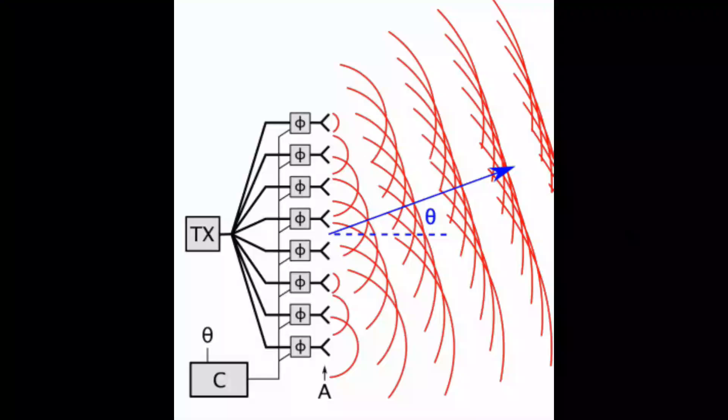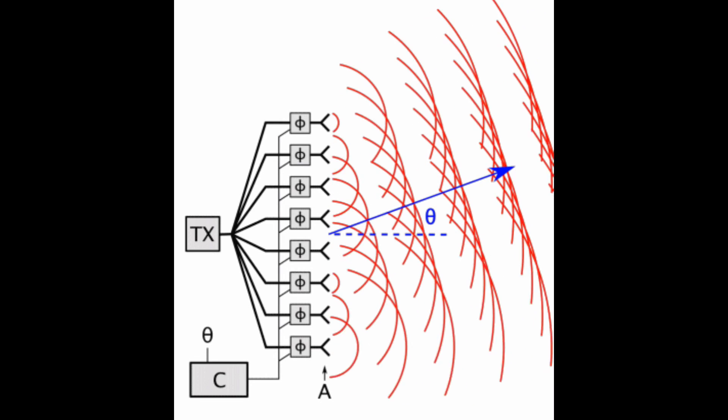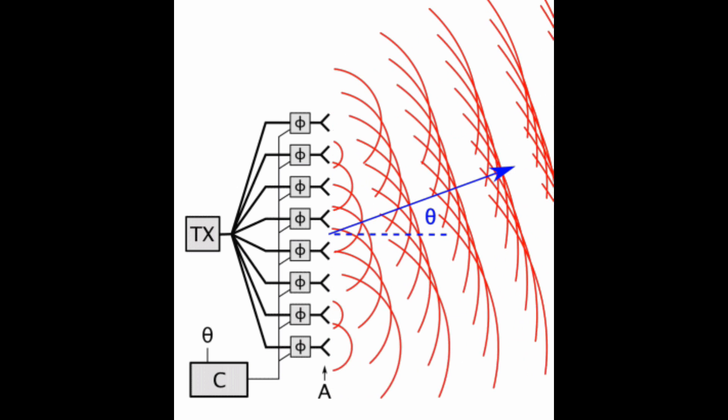The beam is quite broad, so this covers most every azimuth. If you add lots more antennas, the phasing becomes far more complex because the beam width narrows. Reactive networks can provide phase delays, and these networks, consisting of capacitors and inductors, can be varied to change the phase. In the diagram, several antennas are located in a row. The first has zero phase shift. The second has a slight phase shift, which can be created as a phase delay. This goes on down the line, and the result is that a beam is formed in an off-axis direction. It's pretty cool, really.